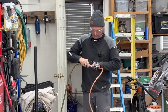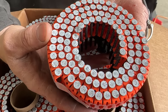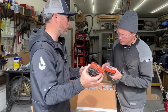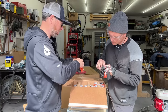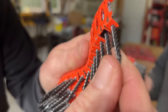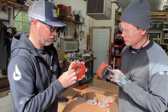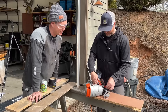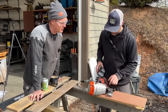Here's our box of Tetra Grip nails — they're coil-collated with a little 'TG' on each nail head so you don't accidentally load them into a regular coil nailer. The specialty is really in the nail itself: it's spiraled with little teeth along each spiral — definitely not your granddaddy spiral siding nail. The black coating might be glue. We're going to load it up and shoot down a scrap piece of sheathing to the sawhorse. I like the idea of nails that hold like screws so you don't get a squeaky floor.